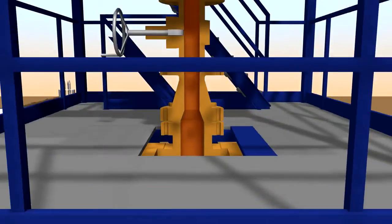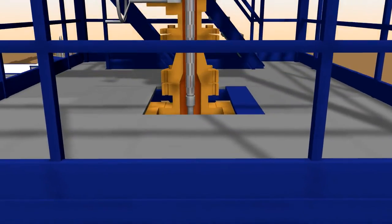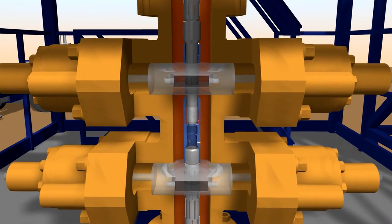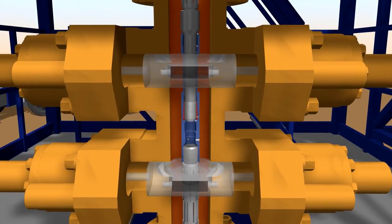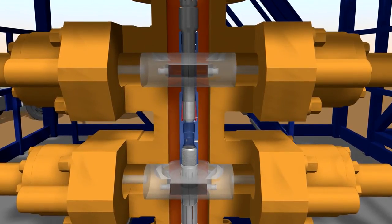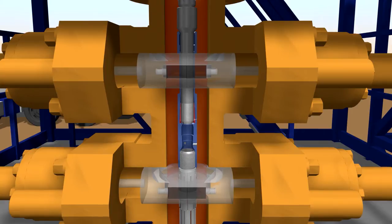When building screen assemblies, sand screens are connected using the Live Well Connector. The grip joint on the bottom approaches the Live Well Connector and is pushed into the grapple. Once the grapple has engaged, a secured connection is established between the two screens. Compared to traditional solutions, this pipe connection can be made up inside the pressurized BOP stack and requires no rotating or special operating equipment.